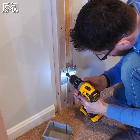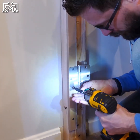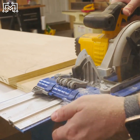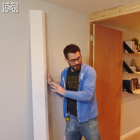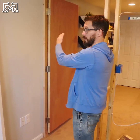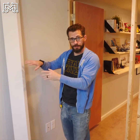Now we're gonna add the mortises for the hinges so that it can hinge off of this door plate. This is gonna come out of the wall about right here, then there'll be a matching one that comes out right here. There'll be two doors so it'll look like a wardrobe, and then on the inside, once those doors are open, we're gonna have a frame right there and a frame around the door so you can't quite tell where the door is. So we're gonna start attaching these pieces together and stick them on the wall.